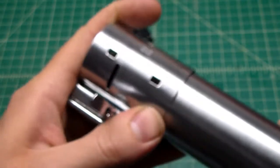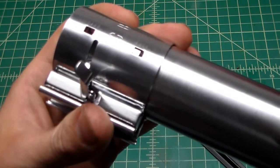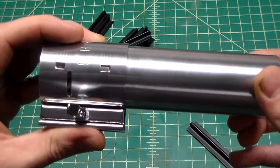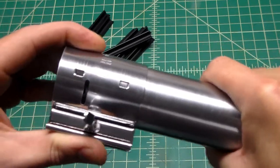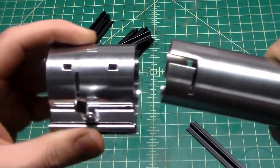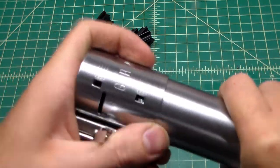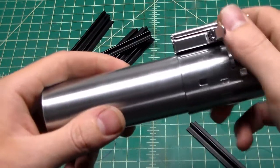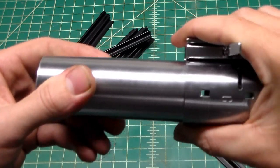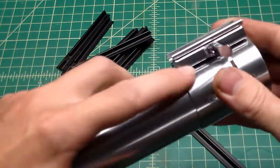So as you can see, if we put this on and then we pull it all the way out, you can see, pushed in, you can see the gap, pull out, disappear. It doesn't turn all the way, so you can't pull it off. You need to push it in and then you can finish turning and pull it off. So that's just a little tip, is when you go to measure, make sure that you pull it all the way out and then take your measurement.